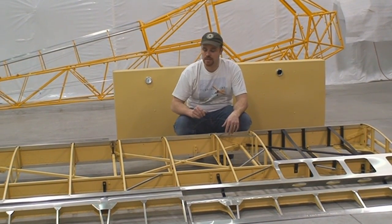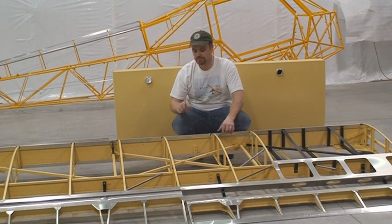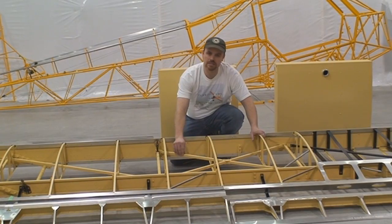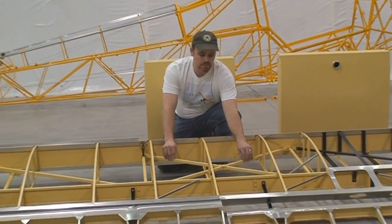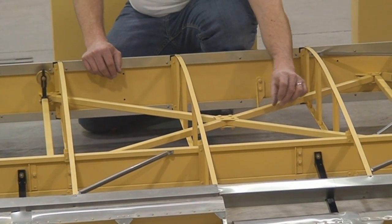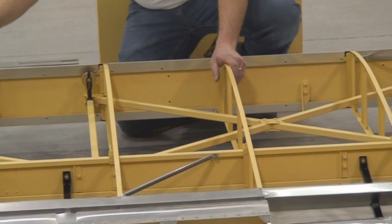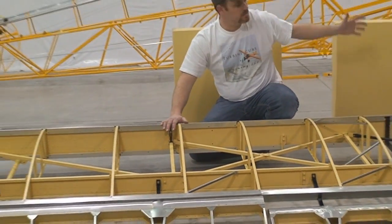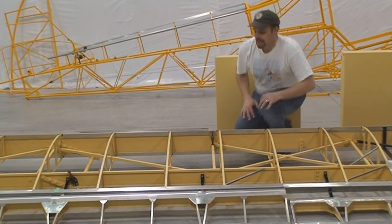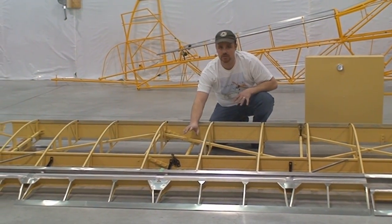We also find from some software we have that 3/4 inch square compression tubing has similar strengths to the drag anti-drag wires. You will notice in this second bay here, we actually do an X pattern. So we're achieving the same thing. The concern is if you only had one tube going through, that under a compression load, that tube could deflect to the side, so it could move sideways. When you have an X pattern, this can't happen anymore. Then after we get out to the next bay, we're getting away from a lot of the wind force, the prop wash, not so much force on the wing anymore. We're okay just to switch over to a single tube. And even here, the side loading is more than sufficient for what loads are being applied to the aircraft.